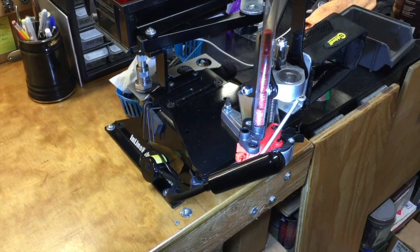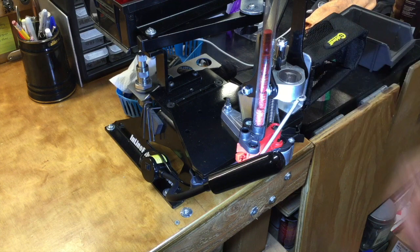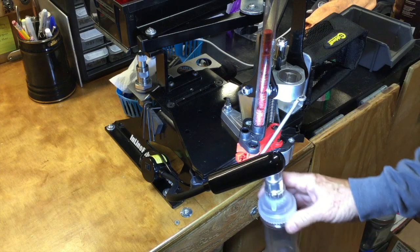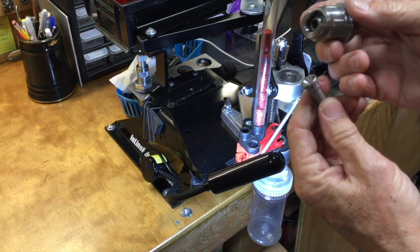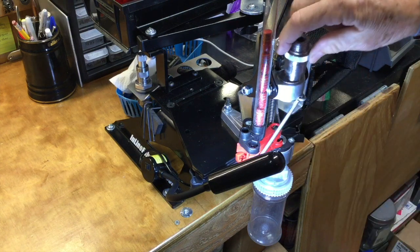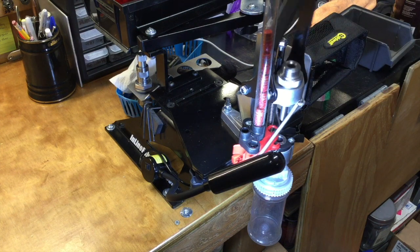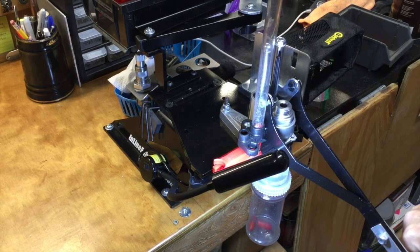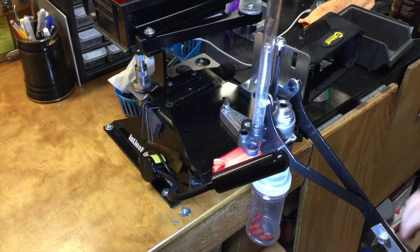All right, so we got a few bullets set up in here. These are for the 3855, and these have already been lubed and sized on the lubricizer, so they're just in there for demonstration purposes. So what we're going to do, we've got the Lee die set up first, and we'll come up in here, install that into the bottom. Then we got to put in our push rod, and that goes into the other Lee die that comes with the press. It just snaps in, and that goes into our top receptacle up here like that. You got to like these breech-lock systems. All right, so let's go pick up the bullet, move it over, drops into the bushing, pick up another bullet, drops into the bushing. Works just fine like that.